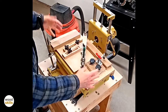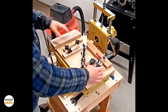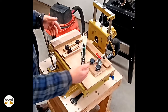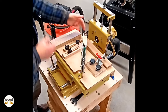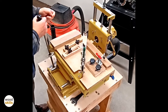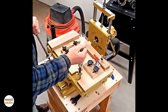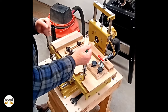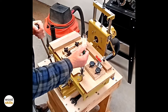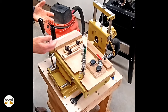And so I've re-established the work holding, added some toggle clamps and some fixtures to be able to mortise rails and stiles using an upcut spiral bit, the 3/8 inch, and then I've added the DeWalt fixed base router to it. Cleaned the rods, lubricated them, it was fairly seized and it wouldn't work at all, but it works. It glides really well now in all three axes, and it's portable, so I set it up on this stand and set up the work holding, and I'm thoroughly impressed with its potential.